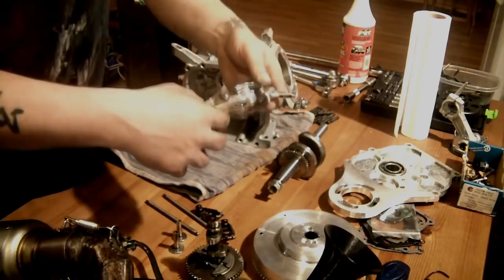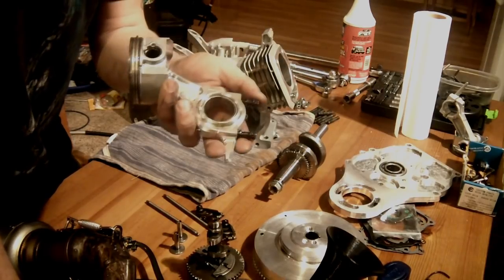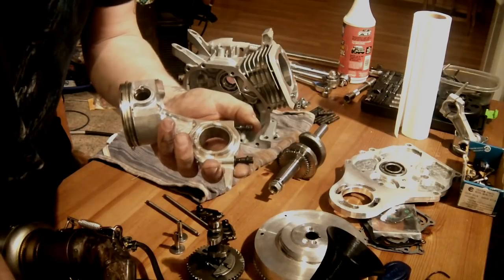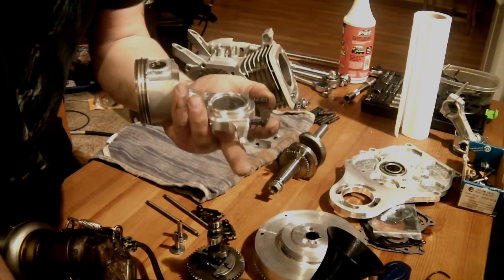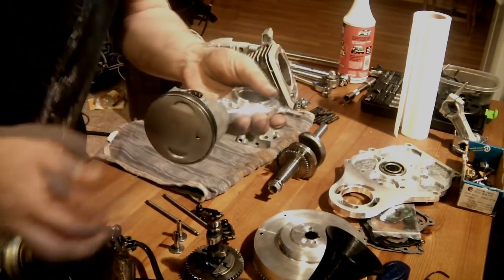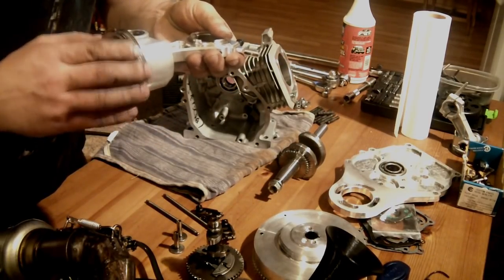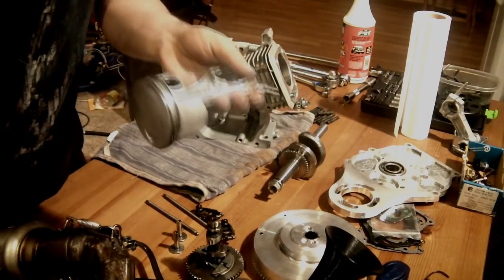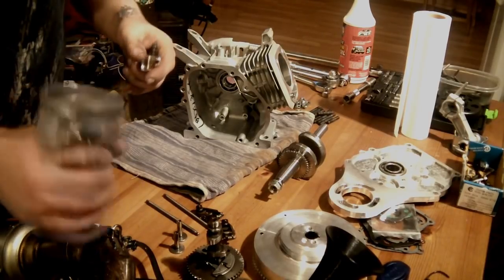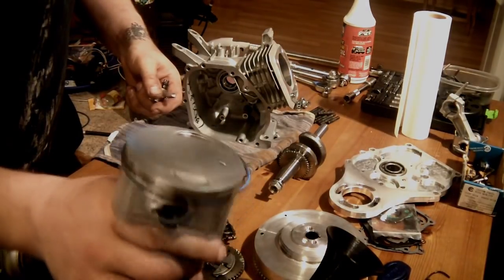I have an Arc rod — it is an Arc billet rod. You absolutely have to have a billet rod if you want to go into higher RPMs, and for paramotoring that is pretty much a given. I believe this is a standard length — 3.308. I do have a stock Hemi Predator piston, but what I did is I machined pockets for the valves to compensate for clearance.